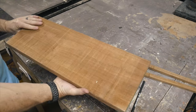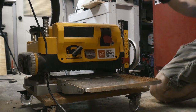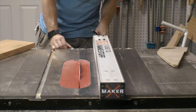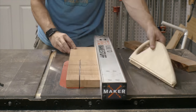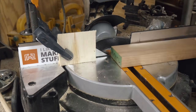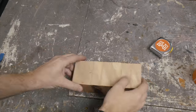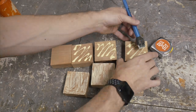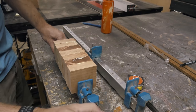I had a couple pieces of teak and a nice slab of cherry that I wanted to use. I ran it through the planer a couple of times just to clean off both faces so that they would glue together nicely. I cut off one edge using the fence and then laid that cut edge against the fence to cut two equal strips. Once I had both of these cut, I used one of them as a spacer to set up a stop block on my miter saw, then turned the piece and cut a bunch of squares. I added quite a bit of glue to one side of each of these pieces and used a brush to spread it around, trying to make sure that it covered as much as possible.